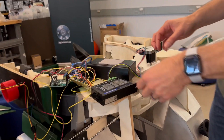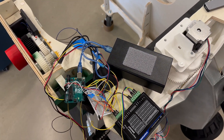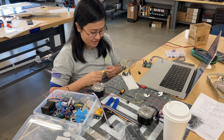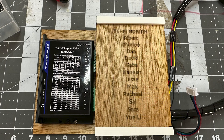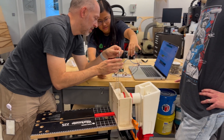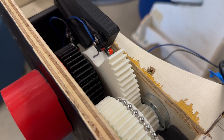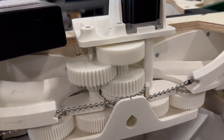To complement the whole gearing system, our friend Yin Li worked on the motor. She was able to combine the use of a stepper motor and an Arduino to control the amount of rotation as well as timing, which allowed us to be a lot more precise in the transformation phases. It was interesting to watch the evolution of her journey because she had never driven a motor before with an Arduino. It started out as just being able to turn the motor. Then I asked her, what if it turns too much — will it break the whole system? So we added some limit switches. When the gearing reaches the end and hits the limit switch, the motor cuts out, and it knows to go in the opposite direction. It was a great evolution and she did a wonderful job.